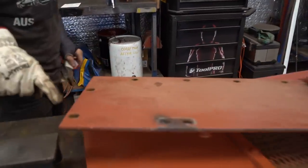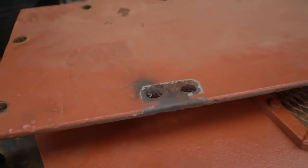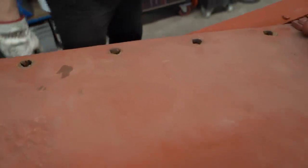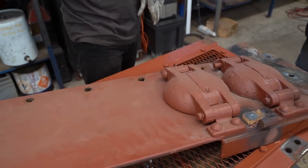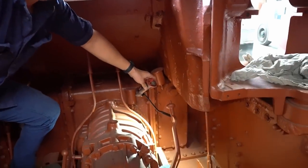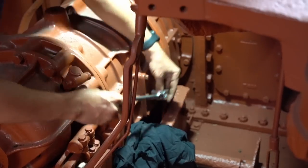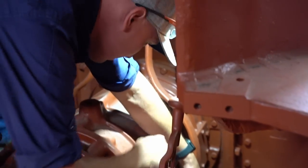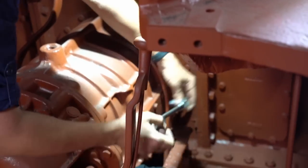Every hole's been oxy-cut out more, elongated. Is this an original one? Well, it's an original one but someone's obviously retrofitted it to suit. There's an inspection plate which is fairly large on the side, so I'm thinking we can just remove these bolts, take this cover off, and we should be able to see inside this part of the gearbox and get an idea of the condition.